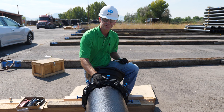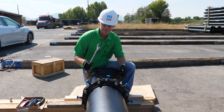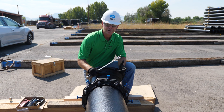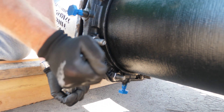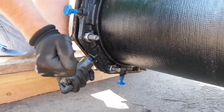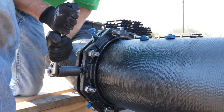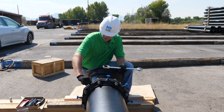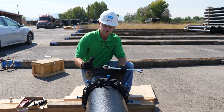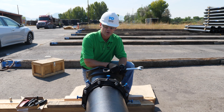I finally have the T-head bolts as tight as I can get them. I'm going to go back around with the wrench and make sure I've got them all as tight as possible. But don't forget, we're not done yet. After that, we still have to go break off the blue restraining wedges to make it a restrained joint, and those will be star patterned once again. After that is complete, the joint is finally assembled. But had we gone the TR-Flex route — drop and rotate — we'd be several minutes, maybe hours ahead, and then could lay more pipe and install more fittings.